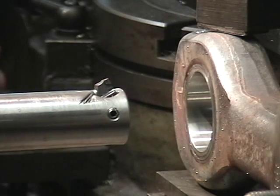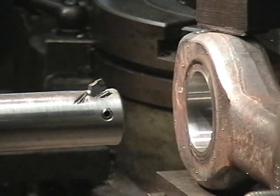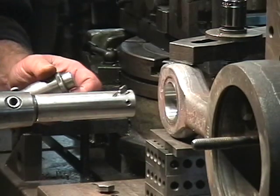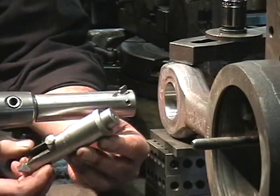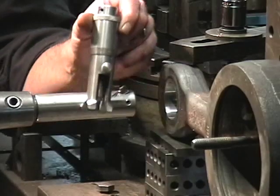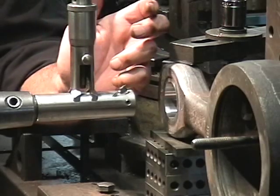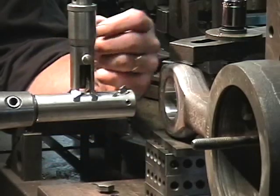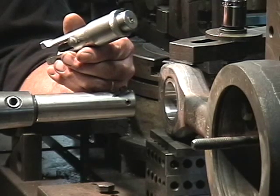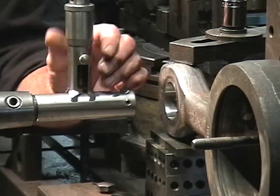How do we set these tools? If you're portable boring, you might be familiar with something like this. This is an old setting gauge from Cedar Rapids Engineering. AMCO had some similar that actually clipped around the bar. The divisions on this are in one thousandths, but it's a large barrel, so you can set and divide easily with this and work to incredibly nice tolerances.